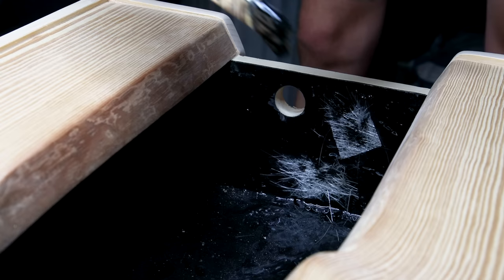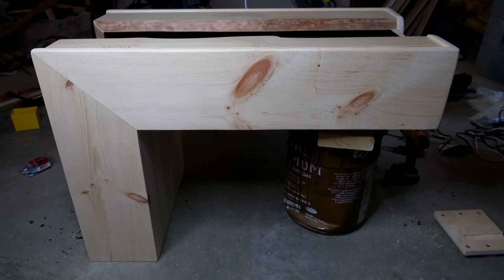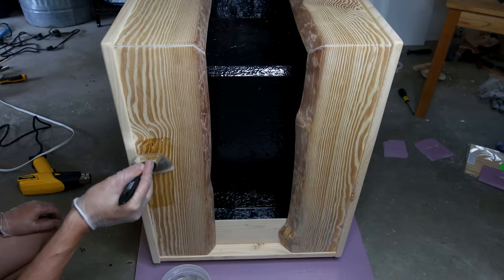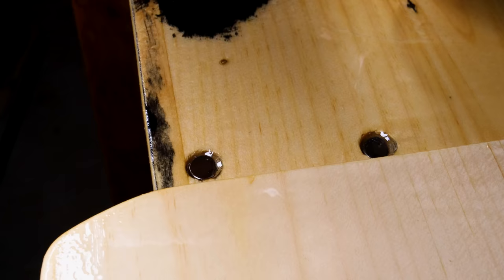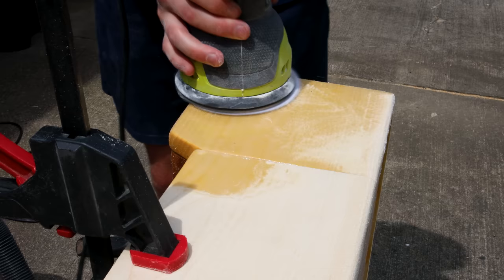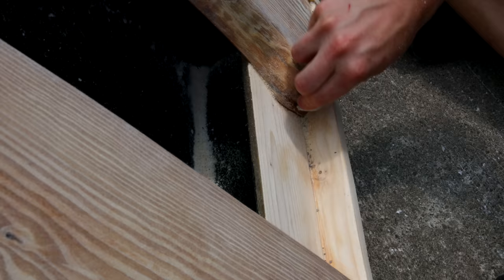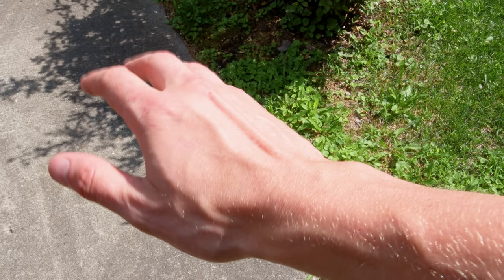Before sealing the outside, I patched the holes from the screws I used to hold the door and secured the magnets with hot glue. I imagined this piece being glossy from the beginning — epoxy was the apparent solution, especially with how beautiful the underside of the live edge looked. I took my time and applied three coats to every surface, making sure to encase the magnets as I did. However, this all failed. There were drips and streaks, and sanding and buffing only fixes this if you apply enough epoxy. Within no time, I sanded down to the wood. It would be nearly impossible to get the finish I wanted, so I had no choice but to remove the epoxy and use something else. It took nearly five hours of continuous sanding to reset the canvas — my hands were shaking and my face hurt from the respirator, but I had to keep going.